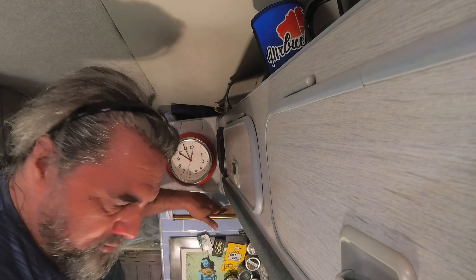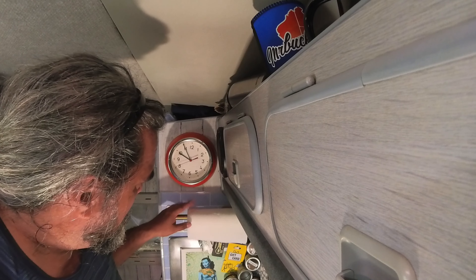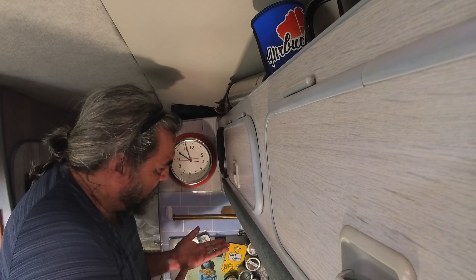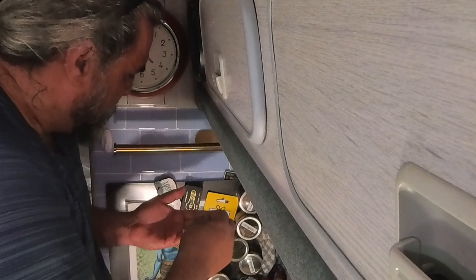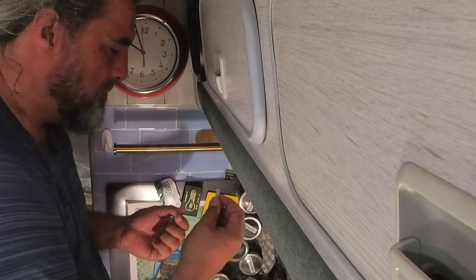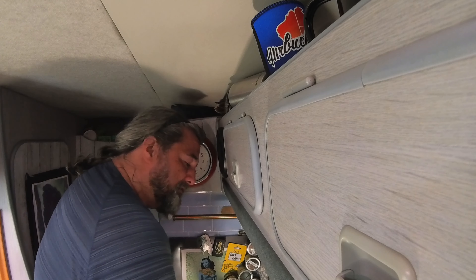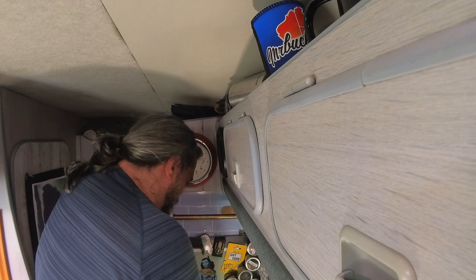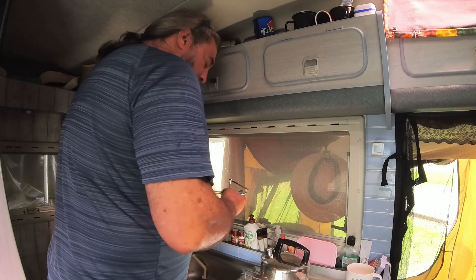The paper towel holder has adhesive backing, so I'm going to stick it on first. That's actually quite strong, and the paper towel is very light. I'm tempted to leave it without attaching the screws. I've had a look at the fittings for the towel rail — I quite like the little fake brass cover. The screws would be okay but a little long, and this fitting is for plasterboard, so it's the right thing but the wrong fitting. For now, I'm just going to leave it with the adhesive, and if it falls off, screws will come.